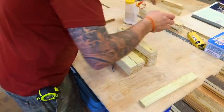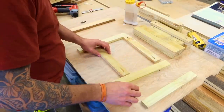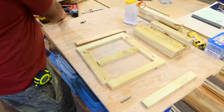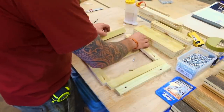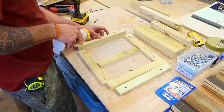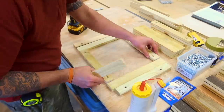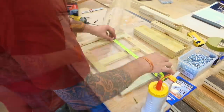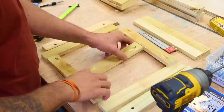Let's go ahead and start putting together some of these wall frames. Each wall frame will consist of a top, a bottom, a center, and two frame sides. Anytime I'm joining smaller parts with pocket holes, I always like to put push boards on the side — this just allows your screws to go in a little easier without your parts moving. I'll be assembling these with glue and one and a quarter inch pocket hole screws. You could probably use inch and a quarter deck screws in the pocket holes as long as you didn't countersink them too deep — pocket hole screws are designed with a flat top to prevent this. So once our outer frame is assembled, we'll put in our center board. We'll be using four of these total — unless you're building the long planter, then we'll be using six total.